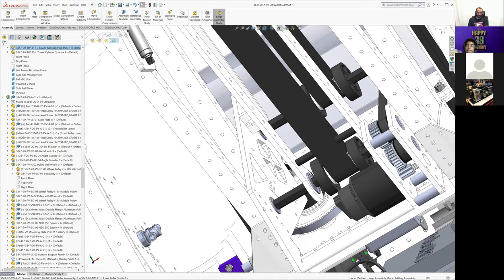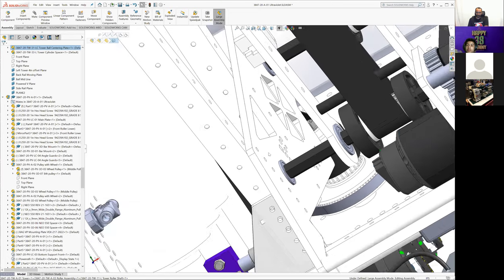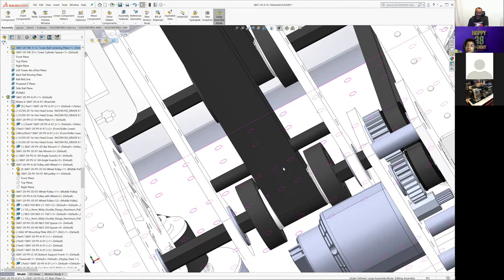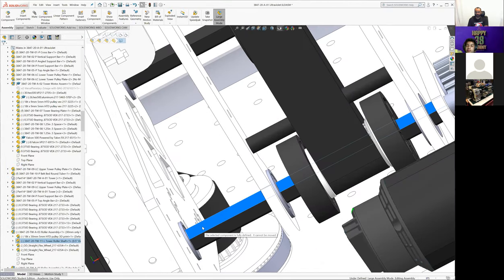We didn't talk about shoulder bolts. All of these shafts have 7/8 bearings in the plate, and then there are shoulder bolts going in from the outside, and these hex shafts or Thunder Hex shafts are tapped to 5/16-18, which is the thread for the shoulder bolt. So you have a 3/8 shoulder in this bearing, and they're tapped into here.